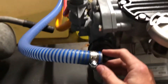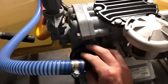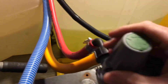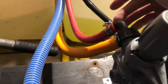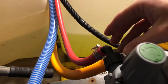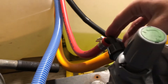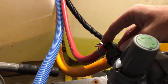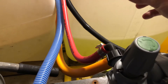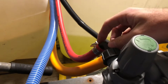Right here you're going to have your inlet — this is the one-inch hose coming off the proportioner — that's going to be your inlet, the biggest barb on the proportioner. Right here you're going to have your regulator, and coming off the regulator is the bypass hose. This is half-inch FlexTech hose. For the bypass, it's critical to have a minimum of 25 feet of hose — if you don't, this pump will overheat way too fast. With 25 feet of hose you're going to get about a 10-minute bypass time. If you need to let off the trigger for more than 10 minutes, you'll need to shut the machine down or squeeze the trigger for a couple seconds to get the heated fluid out and reset. So 25 feet, half-inch hose, coming off the regulator.